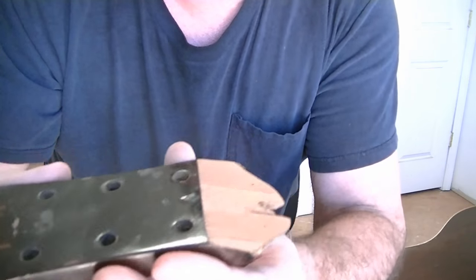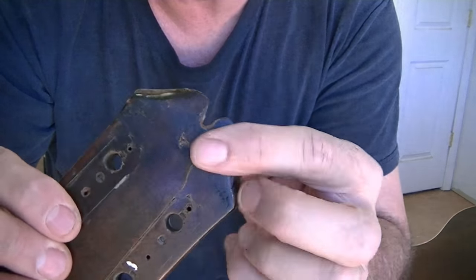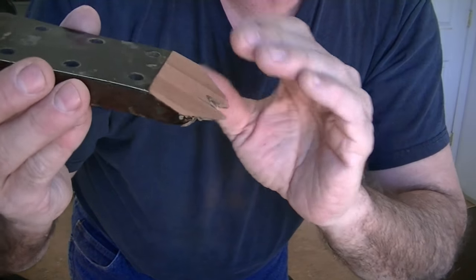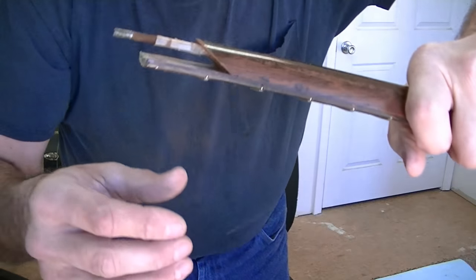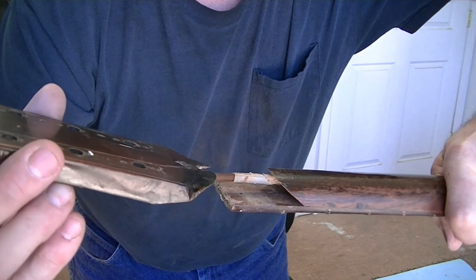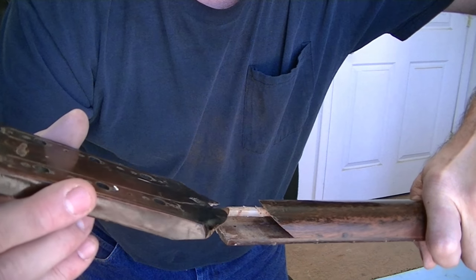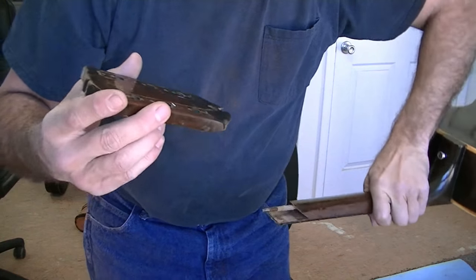What I had to do was cut off all the bad stuff, and even so I still couldn't get rid of all of it — there's still stuff that had been cut out previously. I'm basically going to be able to salvage the whole rest of the peghead. I'm going to cut a piece of wood that will fit in and come back to the neck. I had to cut away the neck also. So we're basically going to replace a piece of wood between here and the peghead, fill that in with new wood, make it match, and the truss rod will function normally. It's going to look good — actually better than if I'd tried to fix it the other way.